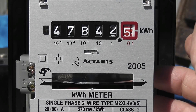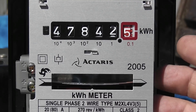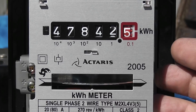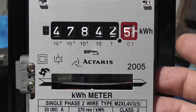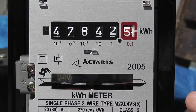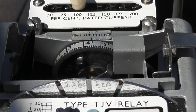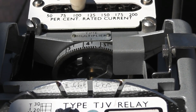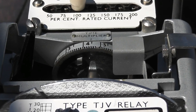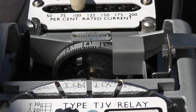Here's a comparison between the relay and a kilowatt hour meter. The disc in a kilowatt hour meter is driven by a current coil and a voltage coil, whereas the protection relay is driven by two current coils set in a phase shift to create a rotation on the disc. The disc is held back by a spring. The time multiplier is set at 0.4 — the disc normally sits at its rest position and gives the amount of movement 0.4 per second.